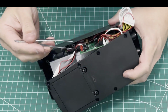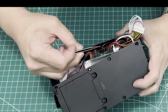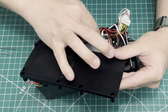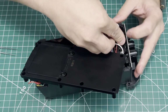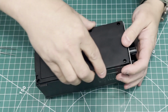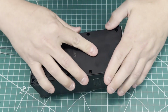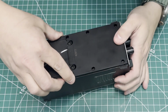And on this side, make sure that the wires here, this is the most pain in the butt side here. That wire likes to hang out right on top of that peg, so you want to get it pushed good and down right in there. And start test fitting and iteratively get stuff moved in place. Don't be too rough. You can kind of coil the original Bargraph wire slightly, and you can see that I've got just the tip sticking out there. Use your finger to push that in, and you can feel where the screw holes and the screw pegs are. If there is anything binding, don't force it.